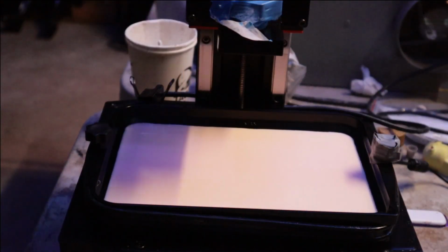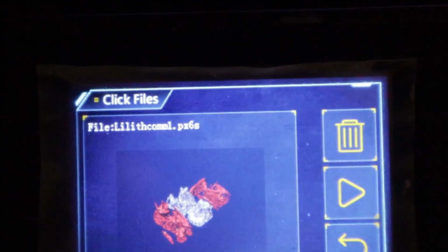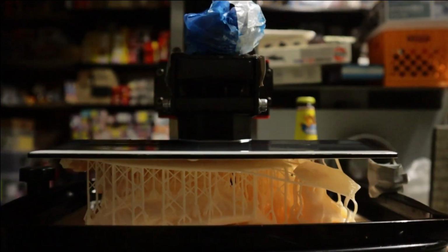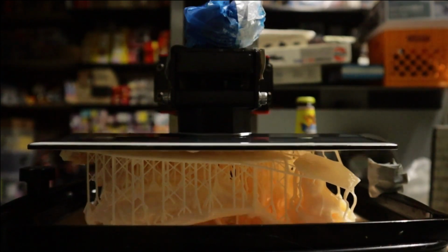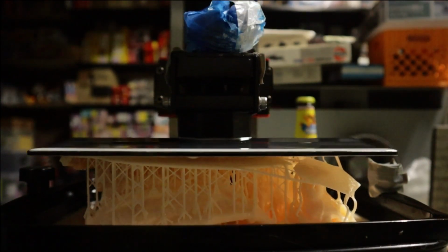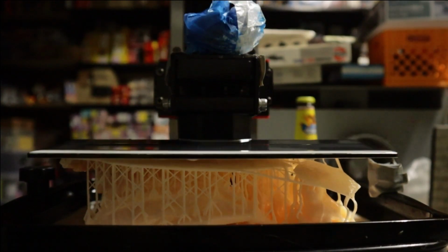I am using the Anycubic Mono X 6K 3D printer with a heating band on the resin tank and an older UV shield, with Sunlu standard UV resin in a flesh color. I find lighter pigmented colors much easier to print, stick to the bed, and have sharper details than grey or black. I made sure the resin was a toasty over 30 degrees Celsius, with a slightly longer exposure time and slow retraction.